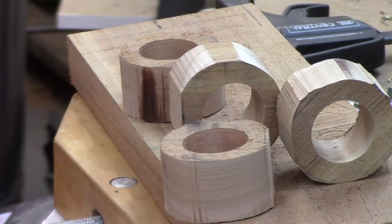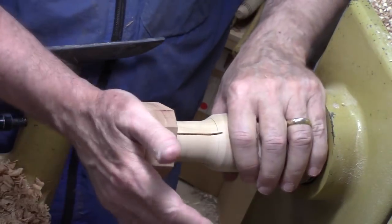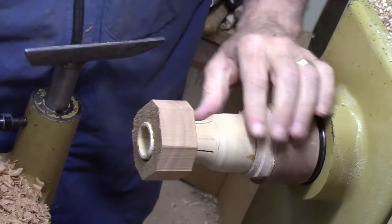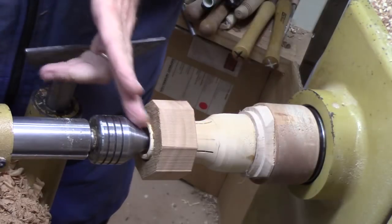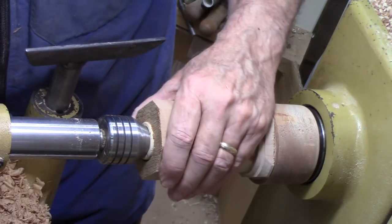Turning from rounded blanks is a little bit easier, especially on a mini lathe, but it's not worth giving it too much thought. Squares will turn round quick enough. Now we're simply going to take one of our roughed-out rings, slide it over, twist it into place, get it parallel, then bring up the tailstock with the 60-degree cone to give it some support. It also opens the collet up and tightens it to give a really tight, secure fit.